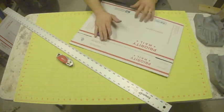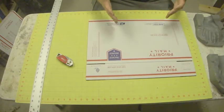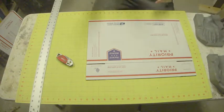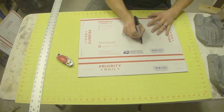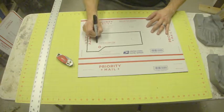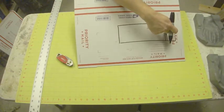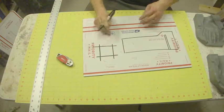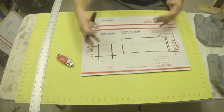Okay, so there are various different ways to do this. I've got friends who take some wood or some plexi or something like that, and they will create something that looks kind of like this. Then they'll cut a hole here, and they'll make 4 of these, and then they'll slide this part through here. So what you end up with is something kind of like this. Because this slot here is larger than that, they'll be able to move this in and out and create whatever size box they want, and it's reusable.